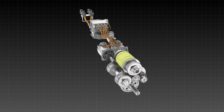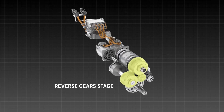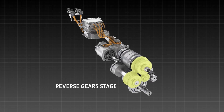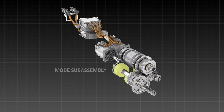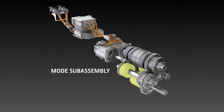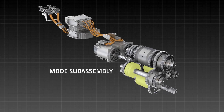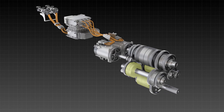The reverse gears can be shifted under load and provide precise control. The mode sub-assembly completes the transmission and spans the speed range over five forward and five reverse modes, providing load transport engine speeds while maintaining power zero and creeper capabilities.